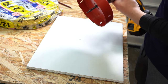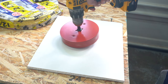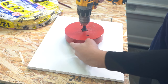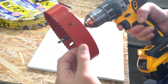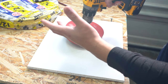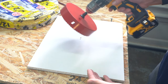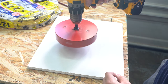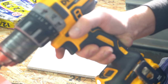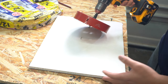Here's a good tip for making the initial hole. You might want to just align the drill bit and go clockwise right away, but the problem is that the teeth of the hole saw can run away in different directions and mess up your ceiling. To prevent that, instead of going clockwise, go in reverse — counterclockwise against the grain first — so the teeth score the face of the drywall rather than cutting straight through.